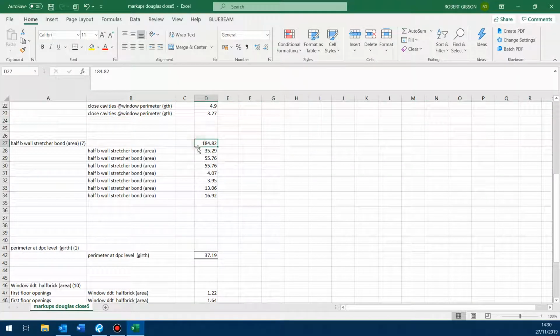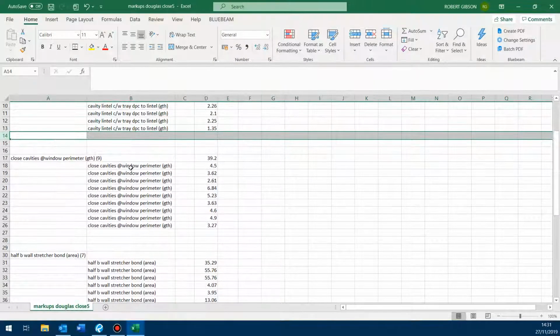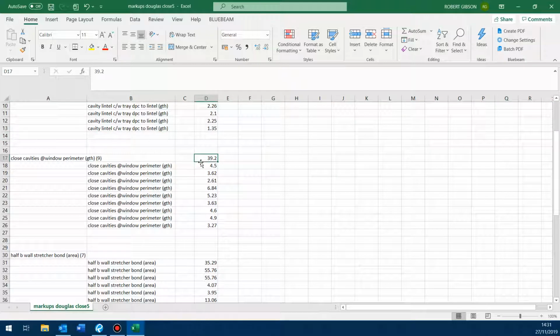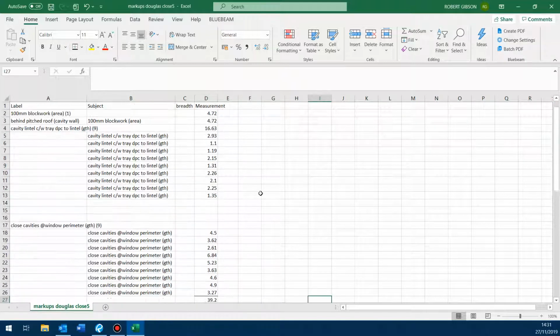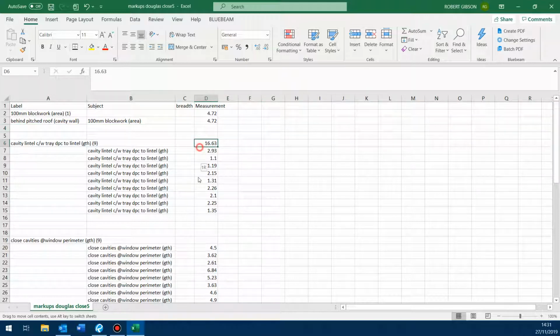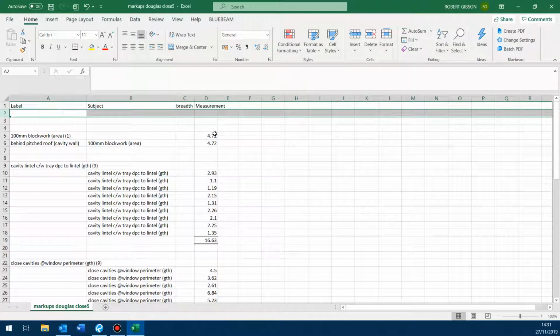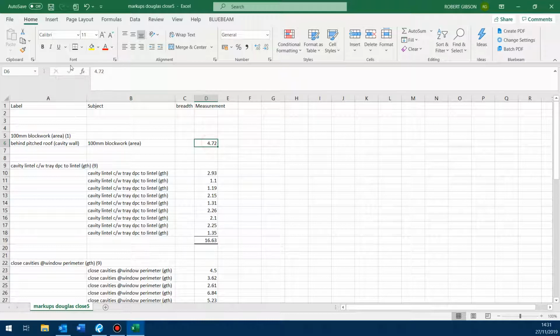And it's becoming a little bit more bill-like, as you can see, but again, it's entirely down to your own preference how you use Bluebeam to measure. I'm just showing you how to measure using the tools, and how to get the data in and out, so that you can then further manipulate. Almost there, and we now have one more to go to make it a little bit more clear.